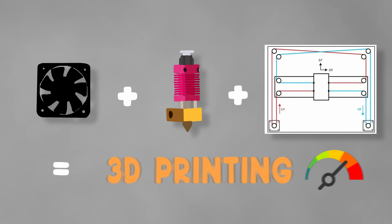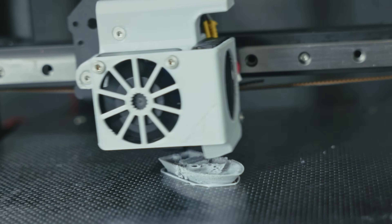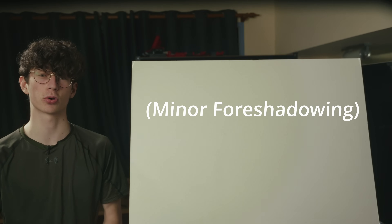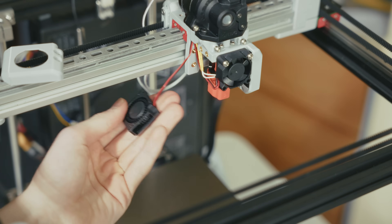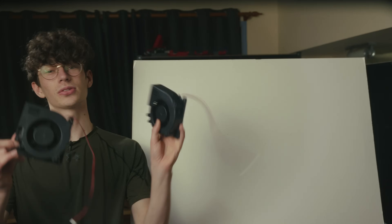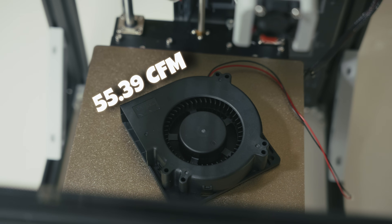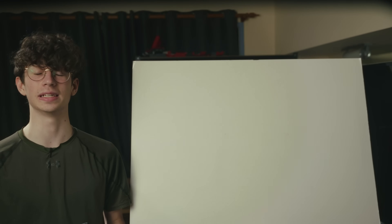Cooling is one of the main ingredients in speed 3D printing alongside extrusion — melting and pushing the plastic — and the movement of the machine itself. If your motion system is too fast and your hotend can't keep up, that's a bottleneck. If your motion system and hotend can keep up but your cooling can't, that's also a bottleneck. I bought 120mm radial fans for auxiliary cooling with a CFM almost 30 times higher than the little 30×10 fans, so part cooling will be the least of my worries. I 3D printed a duct system to direct the air, and by using a DC-to-DC relay we can control the fan speed from the main board — no manual control needed.